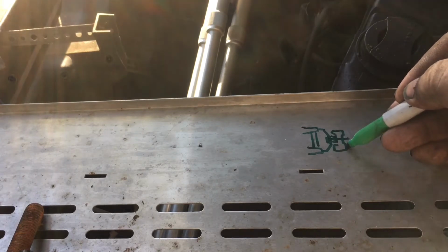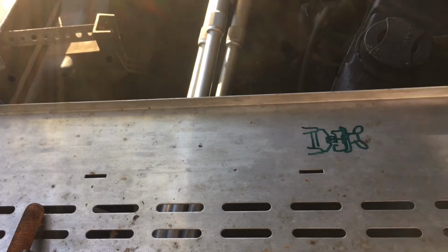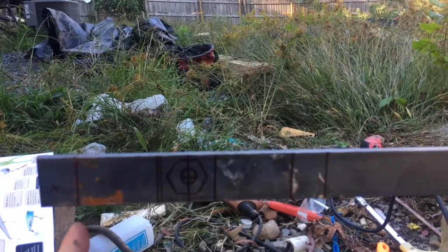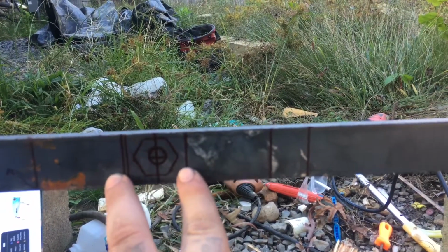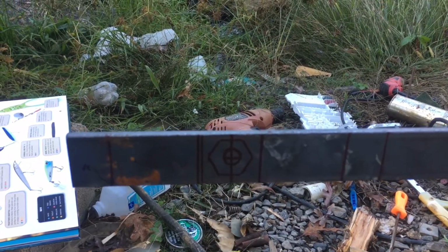And then I'll make a plate to secure the outside with, and then the wing nut. It's not really that great of an illustration, but I think y'all get the idea. But here's the design I have. I'm gonna notch this right here to make it bend easier. Do the same thing right here. We're gonna notch this for 2 bends right here. Before I bend all these into place and then weld them up, I've got to drill this hole out and step it out to 5/8.